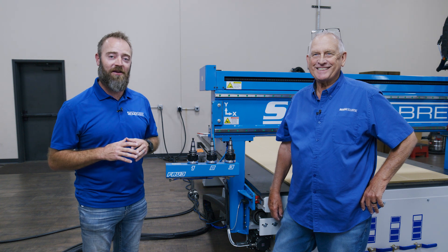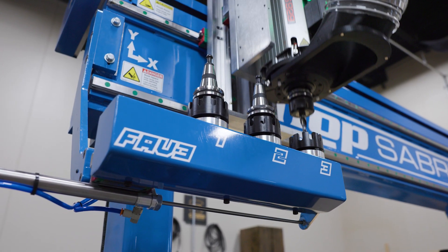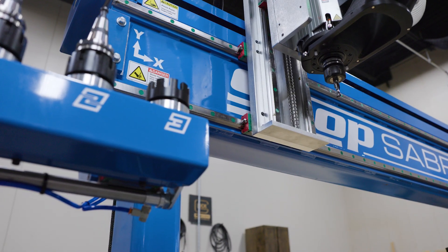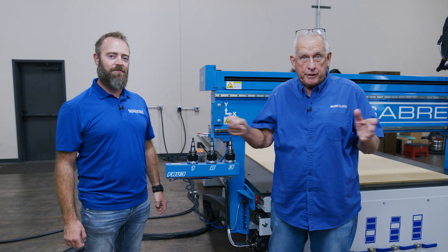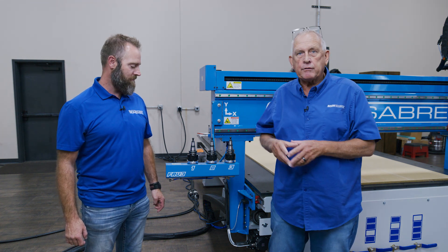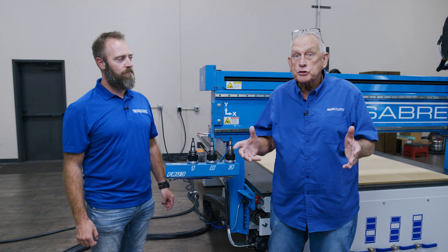What does Fave 3 mean? Your favorite three tools. Now Bob, how did this concept come about? Well, if you look at tool changers historically, the simplest method is the rack in the back because there's no moving parts, but the machine traverses more to make tool changes. So an alternative to that was a carousel that basically moves with the gantry. But that's not simple either because you have limitations on how many tools you can hold. Sometimes if you're running big tools, every other slot has to be empty. So that's not a panacea either.